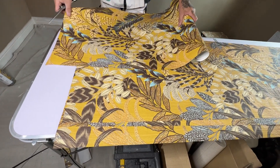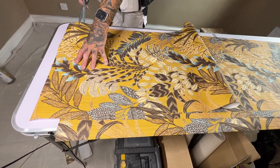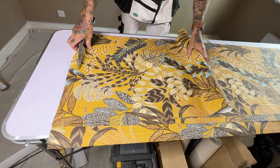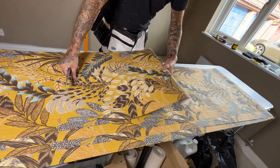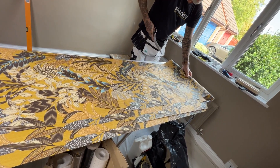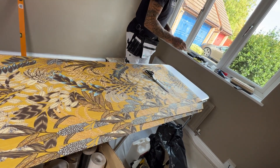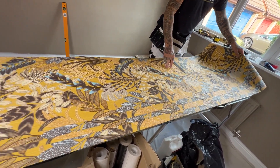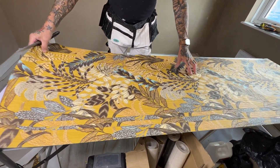Back over there, two and four — that's right. As on every sheet, we've had about three inches of waste, which gives us an outside chance of having a fourth length to a roll. It doesn't happen very often, but it's going to happen this time — I've got plenty of paper. If you work out your quantities with four lengths to a roll, the table can come unstuck because this is one in 50, maybe even one in 100 that this happens.